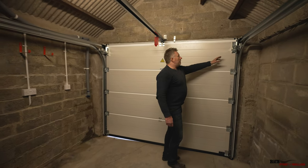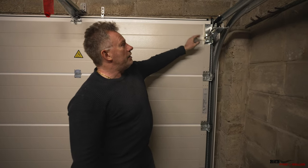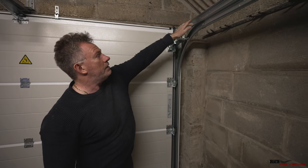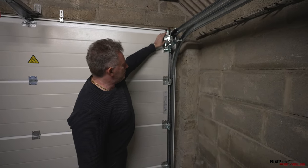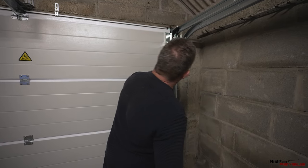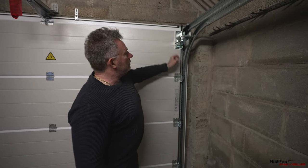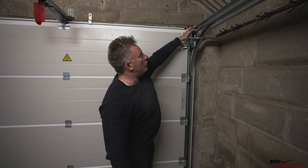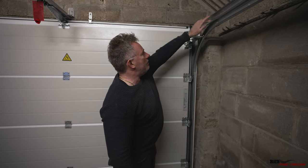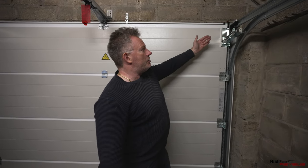So this new bracket configuration provides the capability for the top panel to vent. Normally, this would have a running rail, which would run on the top rail. So this leg on here, you can't really see it very well, but this would normally have a leg on here, and this wheel would be running in this top running rail, and it would be to facilitate it when it comes across to that rail to carry on and to push the panel closed. But obviously that doesn't provision you with the ability to vent just the top panel.